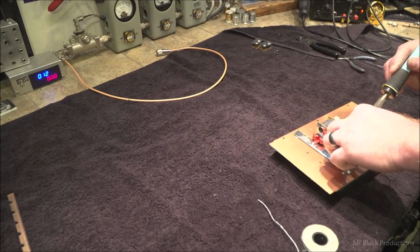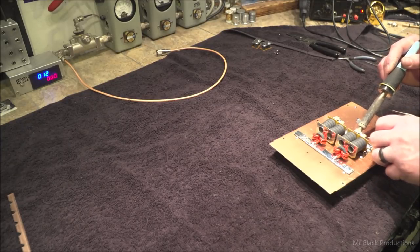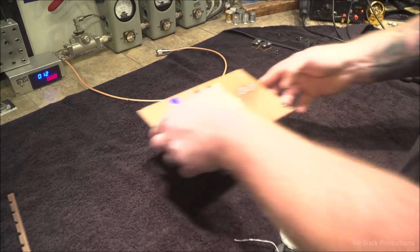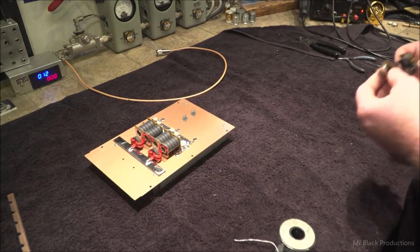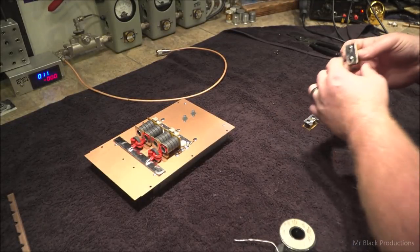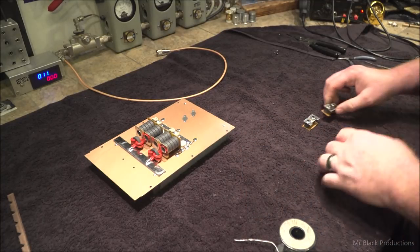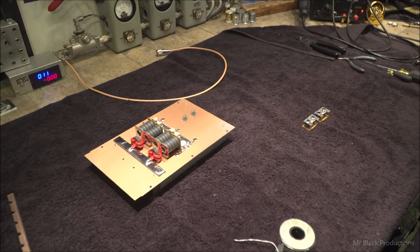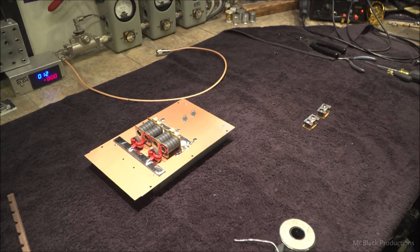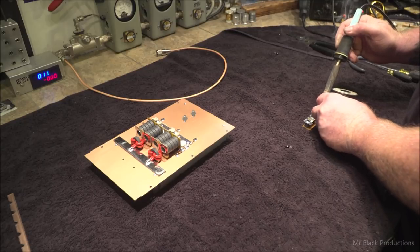Got the transformer just that way, so it's perfectly straight. Let's add a little bit more magic schmoo to the situation. Okay, let's come over here to these. This has got to have sideband on it. And the back of the transformer, this leading edge, I always sand that back. In a Class C box, it's not that big of a deal if the back of this transformer touches the board and for some reason causes it to go to ground. In a sideband based unit, that's a big deal. So we just take it over, hit it on the belt sander real quick, and we're done.